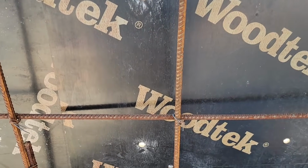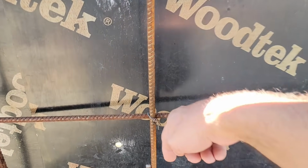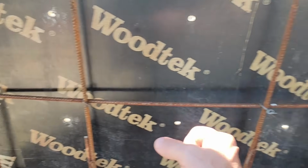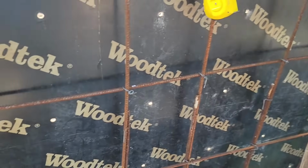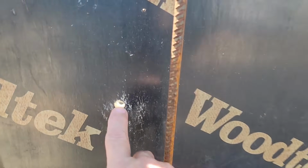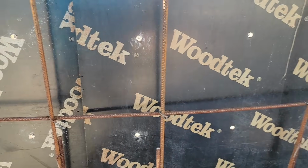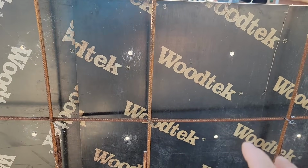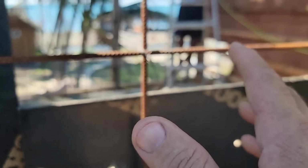What we're going to do is drill into this plywood at 90s and stick out dowels that are tied to this right here where it's doubled up, and stick the dowels out of the wall. Then it'll just leave a hole like this, and when we slip off our plywood, we only have some small extra holes. But here's the thing, these rooms duplicate each other.